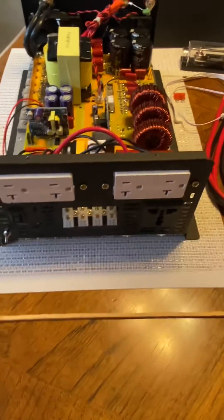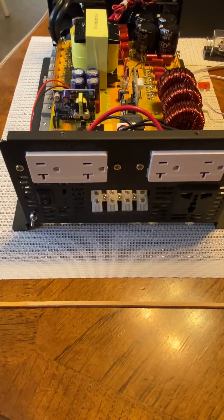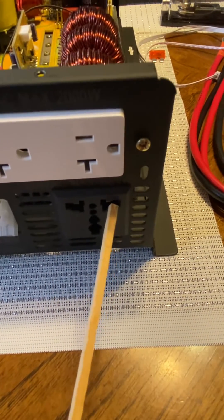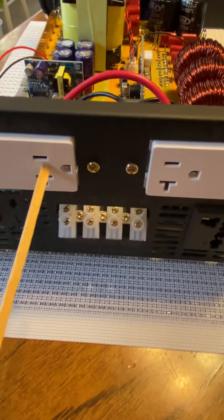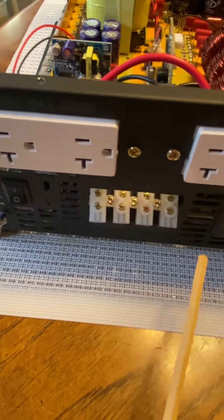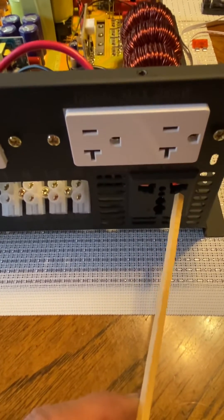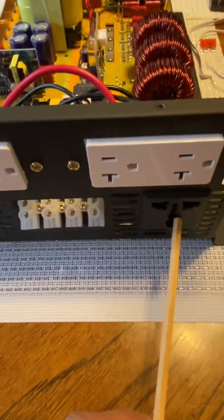They did wire the outlets correctly, which is nice. On these black units, when you have that white outlet sideways, they managed to wire it correctly with neutral and hot properly assigned. However, I noticed an issue with the 220 outlet. You get 120 plus 120 for 240 volts, but the ground just ties in with all the outlet grounds and then also ties to the chassis ground. So if you earth-ground it and plug in something like a freezer or fridge that needs 220 for the compressor and also 110 for the fan or lights, you wouldn't be getting your 110 or 120 from that outlet.